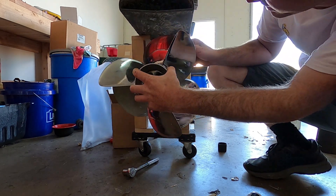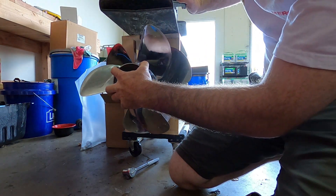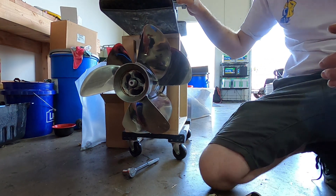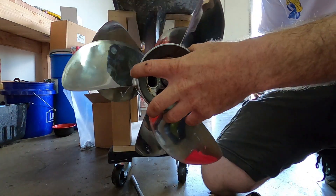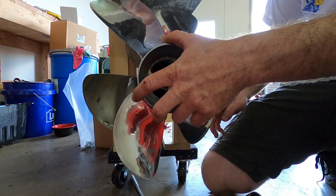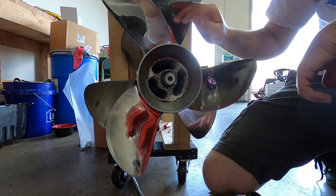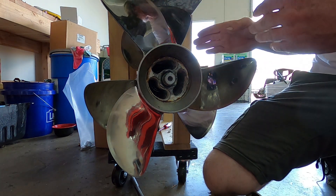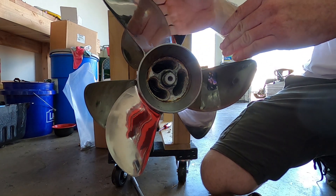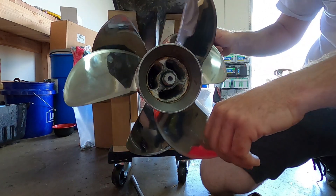If you synchronize it incorrectly where both blades are together, there is a gap where you can clearly see all the way through. We don't want two blades covering over the center at the same time, because water moving off one blade will miss the next blade entirely — that blade will do nothing. So you're really only using five blades at a time instead of six.